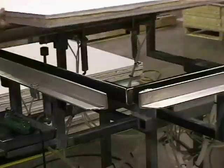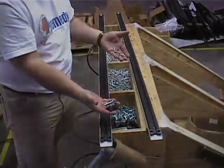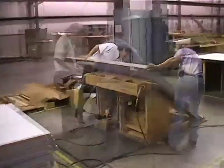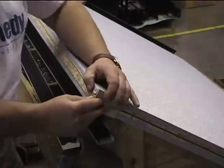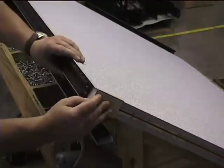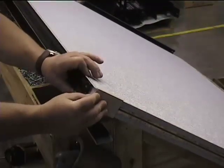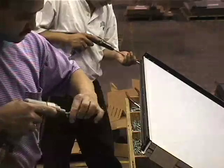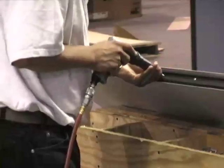Now the panel is ready to move to the assembly operation. First, prepare your hardware — panel shell, hanger frames, connector blocks, and screws should all be at the A-frame table. Put a fabric-covered panel on top and you are ready to go. Match your hardware while preparing to assemble the side of the panel. Use a scrap piece of top cap to line the panel shell up to the top of the panel, flush with the top cap and the sides. Hold it steady and put the screws in place — screw holes are pre-drilled so they should go in easily. Drive the screws into the top and bottom blocks and every other hole in the hanger frame.